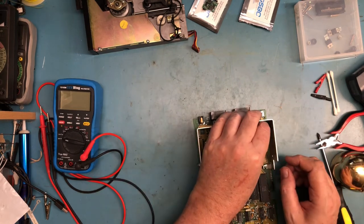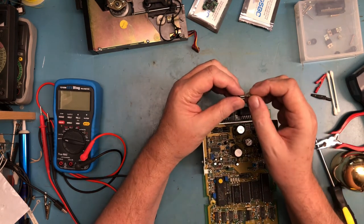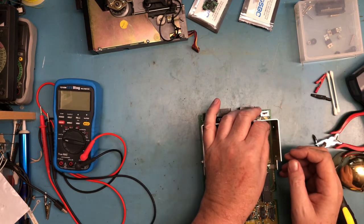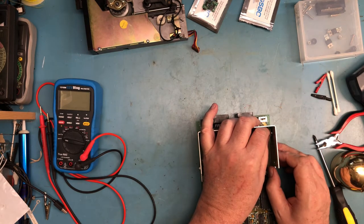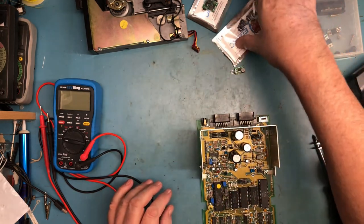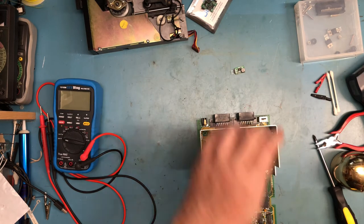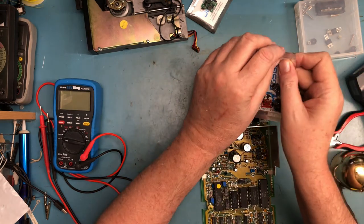It does sit out away from the PCB. It certainly looks like to me I could put a piece of double-sided foam tape behind that to hold it in place. And that would actually bring back some rigidity to the heatsink as well. The width there is about right for some foam tape. Q7, let me look again. Q7 is the 7805, which would be over here. I need one of the blue ones here, which is the plus 12.